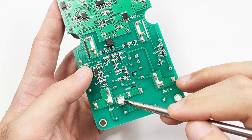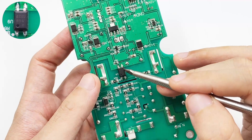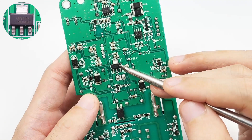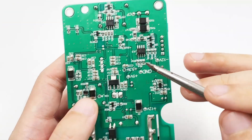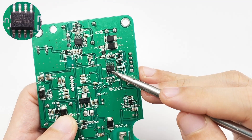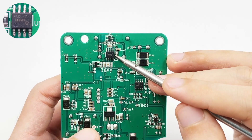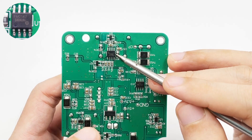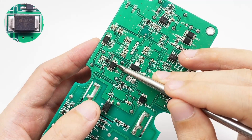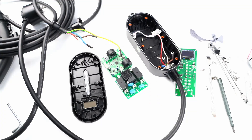This is a gas discharge tube for high-voltage protection. And here is the 814 optocoupler, used to detect the output voltage. This is another 3.3V linear regulator, the same model. This is a voltage comparator from STMicroelectronics LM293. This leakage protection chip comes from Fudan Micro FM2147 and can cut off the circuit for safety. This is a 5V TVS protection chip from Chenda Electronics, used for the protection of internal components.